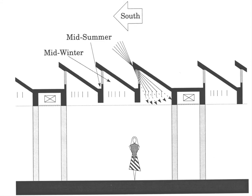This represents another level up where instead of diffusing the light at one point, it's distributed over a larger series of elements and more surface area. These are called baffles. Their spacing is variable to ensure no more than necessary to block all of the beam sunlight that might penetrate through the aperture. So on this south-facing aperture we've got a nice overhang and we're diffusing light over this surface and over these baffles.